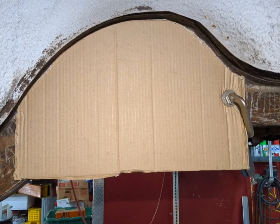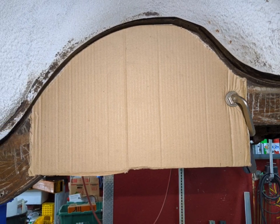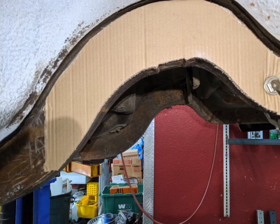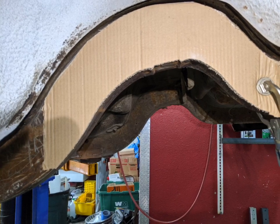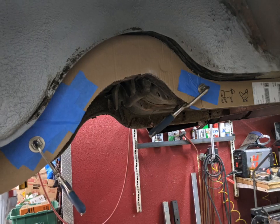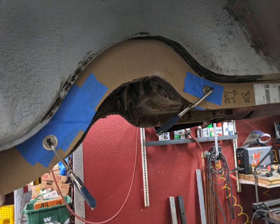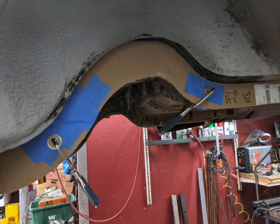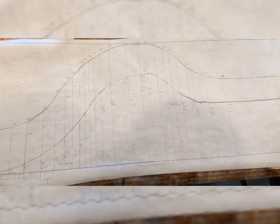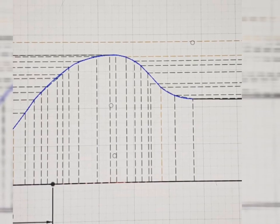I started to play around with the rear sub-frame mounting. I think I might have to reinforce the existing frame, so I'm making a cardboard template. I just clamped it up there and used a drywall cut-around tool and traced the frame. The piece wasn't long enough, so I added a little more to it, got it trimmed up, then laid it on a large piece of Tyvek and made measurements about every inch to get the general dimensions so I could transfer this over to Fusion 360.